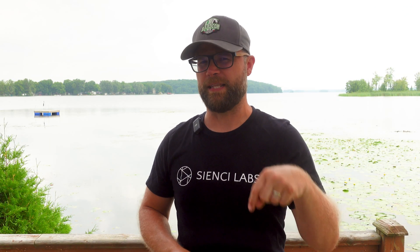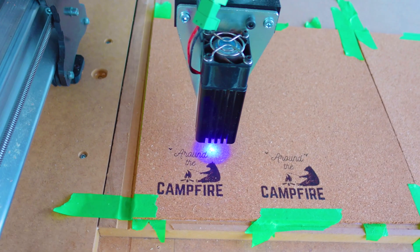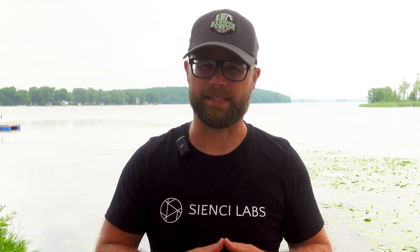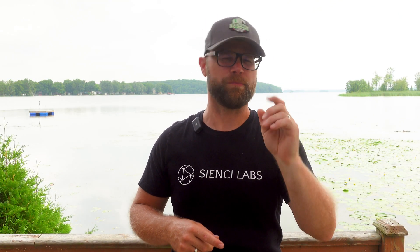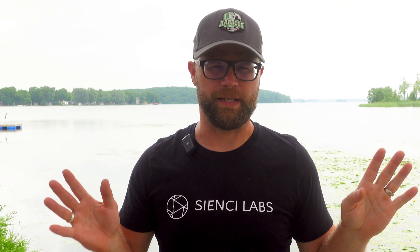I felt the need to give a warning right about here in the video. If you plan to level this project up and laser engrave something after you've carved your bat, I highly suggest you go and watch the Cottage Country CNC Coaster video I did last summer. In order to laser engrave your bat, you're going to need to know the offset distances between your router and your laser. Doing this before you start carving will save you some time and a little aggravation in the long run. I'll drop the link in the description below.